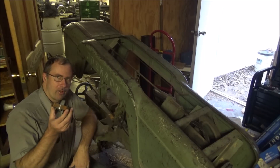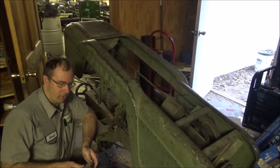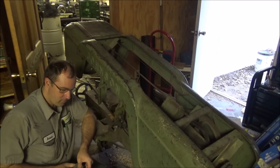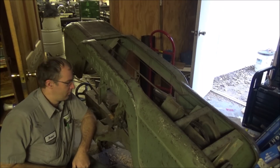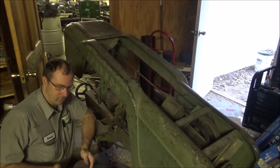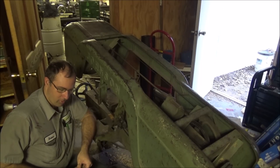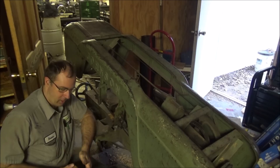But first I've got to get all these pieces cut out of this bar stock. According to the G&L spec they're three quarters of an inch thick, so that's what I'm sawing off. I usually try to shoot for my saw cutting within five thou per inch. Let's cut one off here and see how close I am.